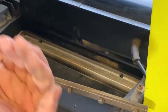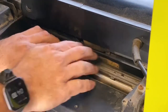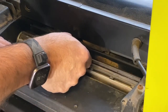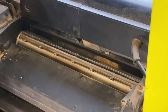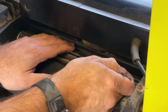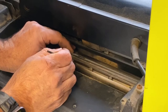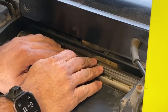Make sure the cup is facing up and the flat facing down, and then screws towards you. Drop that in place. Okay, grab the blade, flat bit facing you. And 45 in, drop it in there, and again line it up. And then start tightening up. Make sure the blade's locked into the bar, make sure it's centered on the drum. Make sure it can spring up and down.